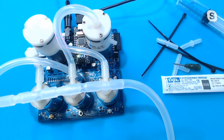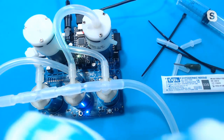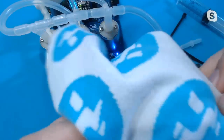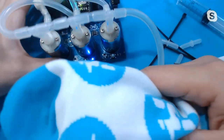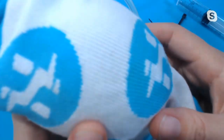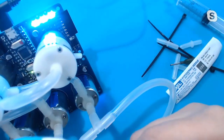I'm going to reprogram the board so we can do this other thing. I made this balloon sock demo — it's just a balloon inside of this sock here. It's on a timer: the idea is to have a little lotus shape that's 3D printed and it'll expand and contract. When it's expanding for about 10 seconds, the lights are green and the balloon is inflating and you're supposed to be breathing in. Then you hold your breath, and then for 10 more seconds it slowly deflates. It's not pumping air out — it's just stopped pumping and opened the valve so the air can slowly flow out.